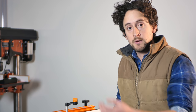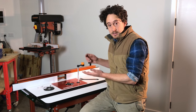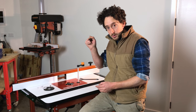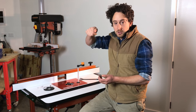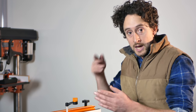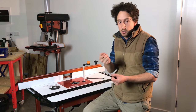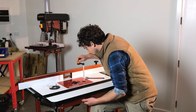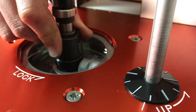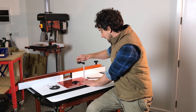So even though the motor isn't running, that switch at the back is turned on. To get this to full height, you need to disengage that back switch. That allows the motor to come to full height and it allows the spindle lock to engage — a little pin that pops into the spindle itself — and allows you to then use a spanner to tighten or loosen the nut on the collet. If you don't allow that spindle lock to engage, you just don't have anything to hold the collet against. So all the way up, turn it slightly and the spindle lock engages. Then you can use your spanner to loosen it off, put your bit in, tighten it up, and then just drop it down.